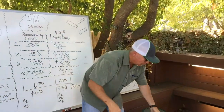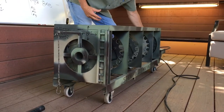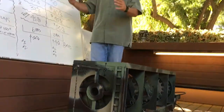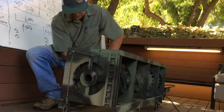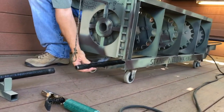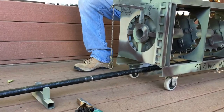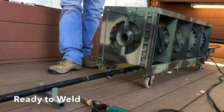We have two in the wheel, so the wheel will be completely loaded. This thing spins crazy fast — I'm going to try to slow it down. So one drops into the conveyor. Basically when the blocks are gone, you can discharge your first pipe into the conveyor. Then you lower the conveyor and the pipe will come out on its own. You'll have to probably regulate the speed. One guy will be in the back guiding the pipe over to the other pipe, then you'll make your final adjustment. So there you have a pipe ready to weld.